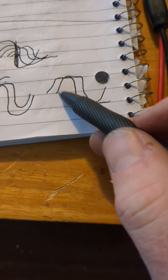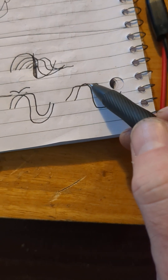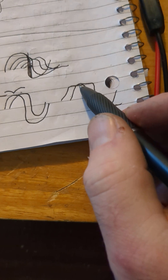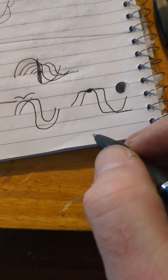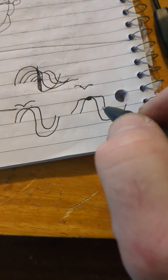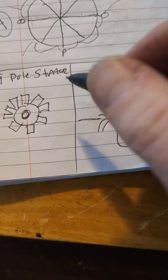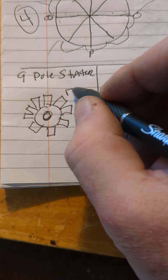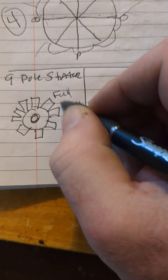So I have to get sine waves that are flat on the top, then the next one flat on the top. So the overlap is two flat lines — you don't have a dip there, you just have a flat line. So when the virtual rotation happens, the magnetic field is in full strength as this one's also in full strength, so there's an overlap.